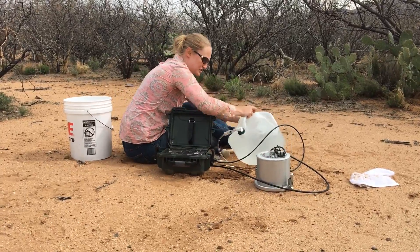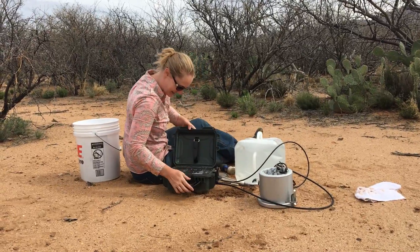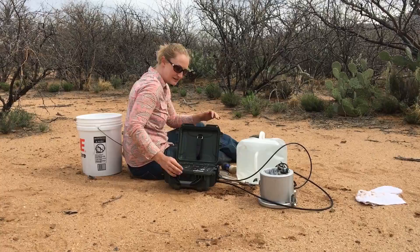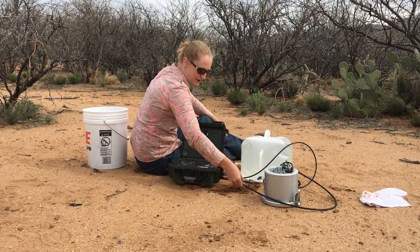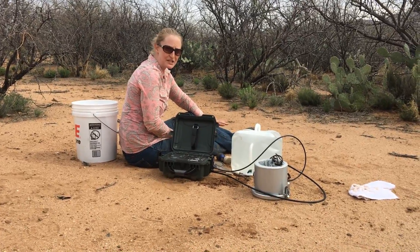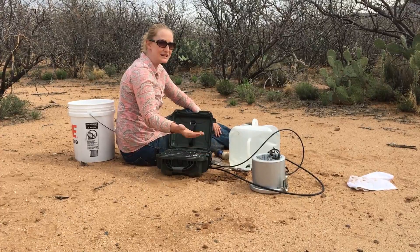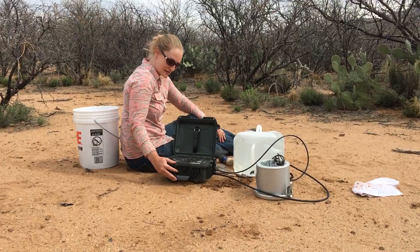When you go down to start, make sure that your water tube is facing down. Push this lever up so that the water can come out, then hit start and enter. It says 'check water supply and tubing and sensors' — we make sure everything is secure, our water is on, and we push enter. We hear it start pumping the water, and after about 30 seconds we see the water coming through this black hose and going into the chamber. It will go through a period of equilibration first. Once the water reaches about 5 centimeters of depth above the soil, it will start its soaking phase. We have it set to soak for 20 minutes, after which we expect the area within that 10 centimeter ring to be saturated. After that, it goes through the two cycles we have set, and at the end the machine records all the information and turns itself off.